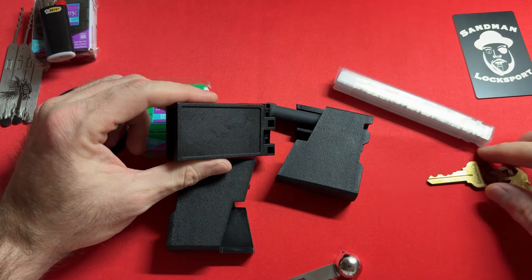Of course, if you are working as a super secret agent, you are probably going to be ditching that key. What's great about this is it allows you to only hold the customer or target's key for less than two minutes. I will be able to make a casting of a key in a timeframe of less than five minutes — probably two to five minutes. If everything here was prepped, I would roll up with this preloaded with molding clay and ingots, everything prepped with baby powder on it and closed so the clay doesn't stick. You could probably do everything inside of two to five minutes.